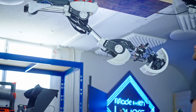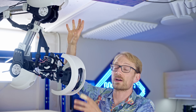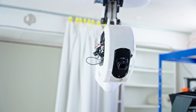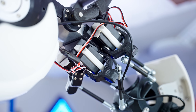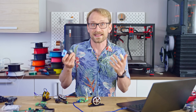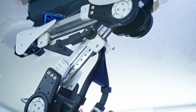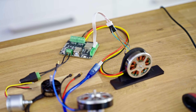This does have the downside of a slightly limited useful range of motion, but any kind of robot setup has sort of a preferred motion range. Plus, this will eventually be on a track on the ceiling, so range of motion isn't going to be a huge issue anyway. So far, total cost in material for all of this — if I were to buy all the parts — is about 500€ on the dot, with the servos and ball links for the head making up almost half of that already. So maybe if it's just about running a camera, a classic gimbal-style head would be a better option overall. But I think I'll replace the stepper hardware anyway — steppers are pretty noisy and skip steps too easily, especially running fast. Brushless DC motors with FOC software to turn them into servos look like a much more robust solution overall.